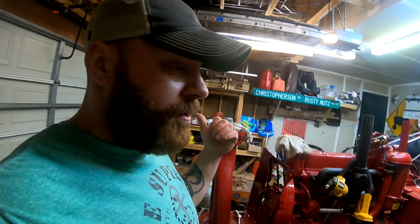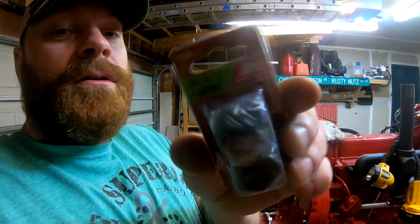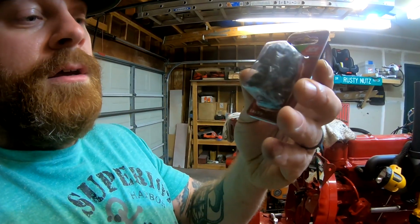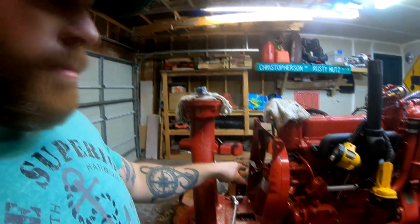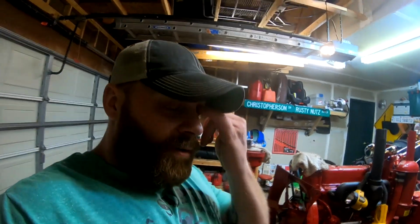So I went and got some more graphite packing, which is right here. Got it from my local Ace Hardware. It's 40209 graphite packing. It's an 1/8 inch by 24 inch length. So we'll put some more packing in the water pump. If you want to double check that video, just check it out. I'll put the link in the description below.